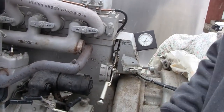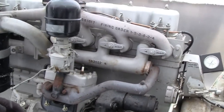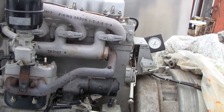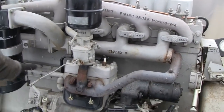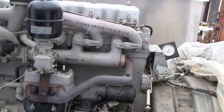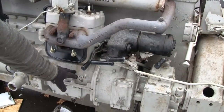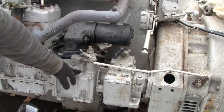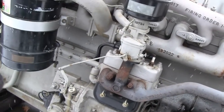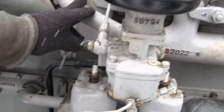Well, we're getting oil pressure, and we're getting oil to all the points. But most importantly, we want to heat up the diesel block. We're using the coolant that's going through the pony engine to heat up the diesel block. Yeah, show them where that is, Mike. This is the engine. This is the clutch housing. This is the transmission for the Pony. And like you said, the engine coolant goes through the engine. It comes in here and goes out here.